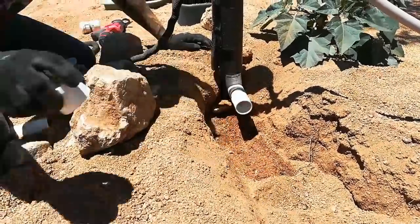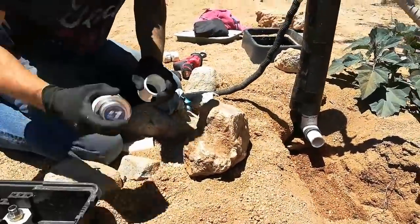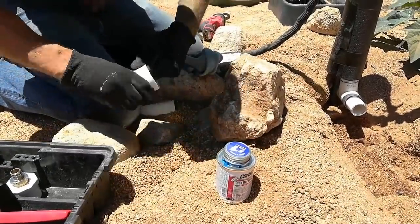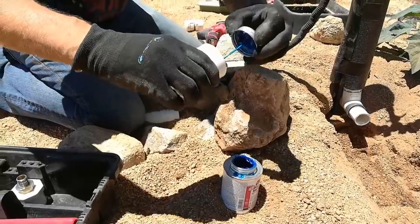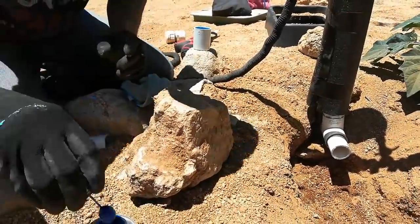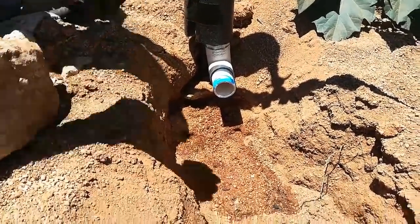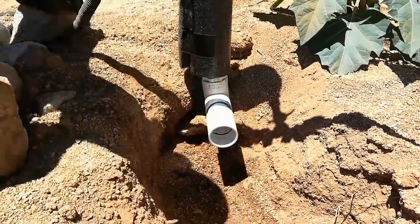The slip coupling is going to go around there — I'll glue that on — and then this slip will go inside here, and our PEX will attach to this. The glue I'm using is a one-step product where the primer is built into the glue, and it's a wet-dry product — kind of like rain or shine — which can be used for irrigation. I'm going to make sure I get both the coupling and the pipe covered with glue, put it on, give it a twist, and get it to seat all the way. I'll give that a second to dry.